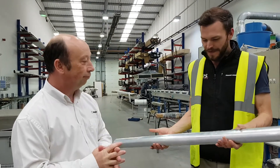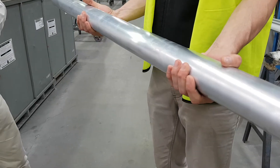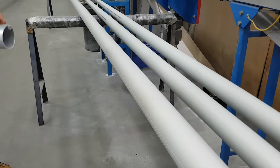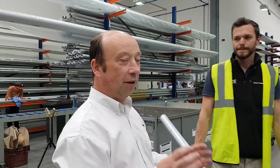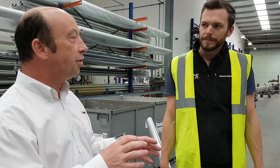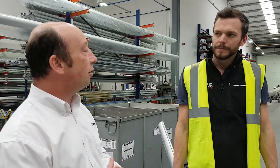So we're at the cleaning process. This is the kind of shape that comes out of the oven — quite a shiny finish to it. What we're hoping to achieve is a matte finish, using this machine here — a bead peener, which is like a shot blaster. The mast travels down the wheels and goes through the blast cabinet, where we fire glass balls at the surface of the metal to give it a nice even matte effect. It also hardens the surface slightly, giving a bit more resistance to scratching and marking, and it makes the anodising grip better to the surface of the mast.